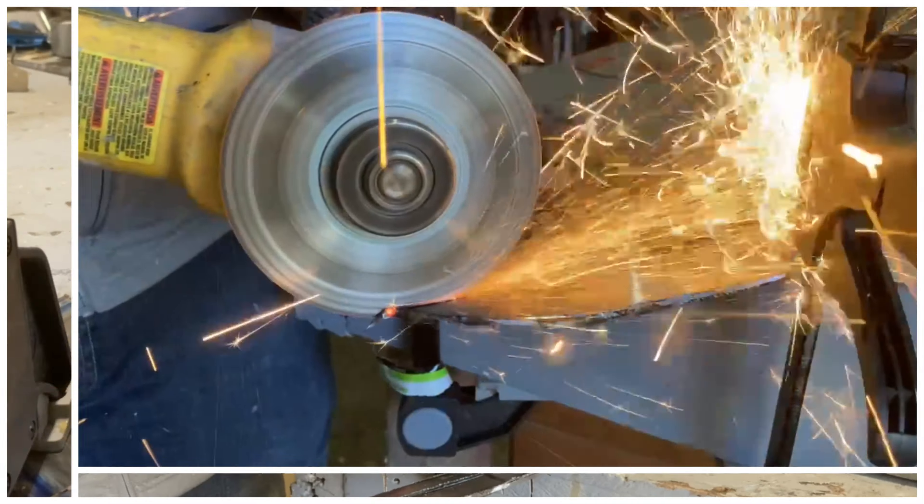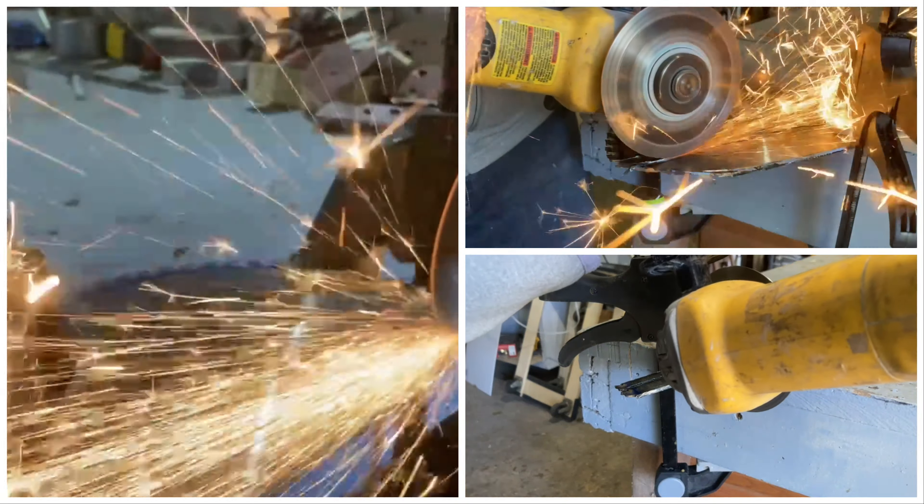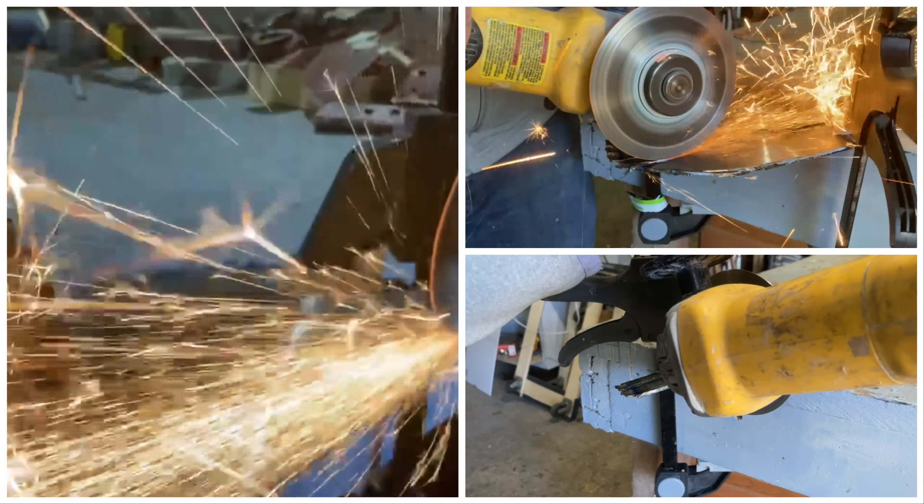After a little bit of experimentation, I realized that the easiest blade to use in my angle grinder to cut these saw blades is actually a tile blade. They're really durable, you can use them multiple times, and they make really smooth cuts without a lot of kickback or anything. It's really, really nice. So that's what I'm gonna be using.